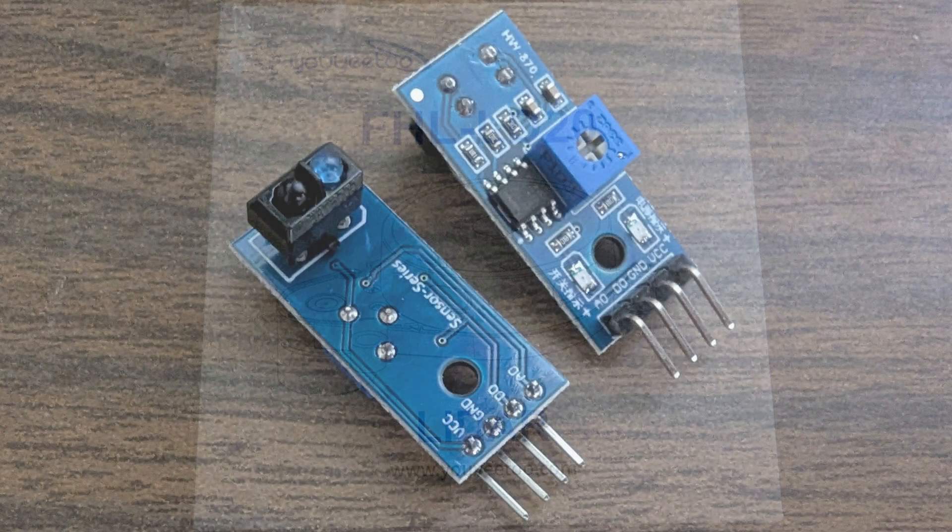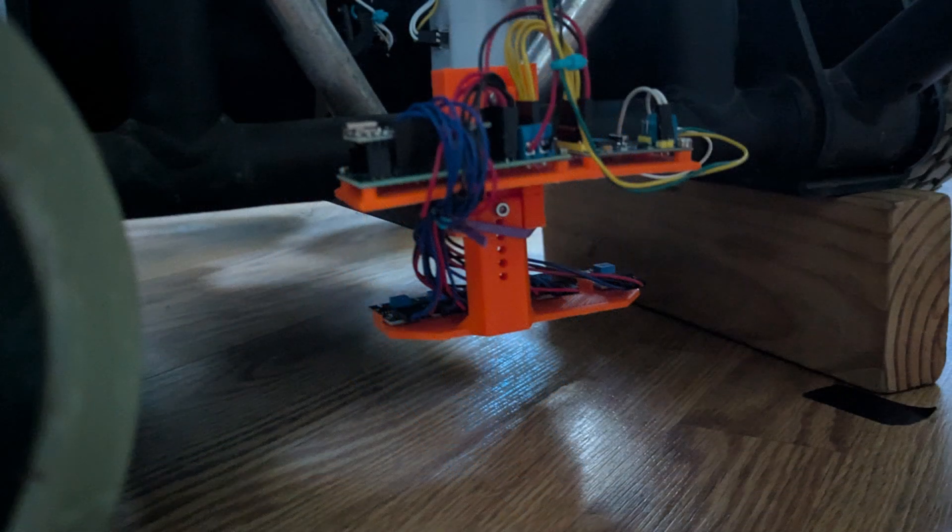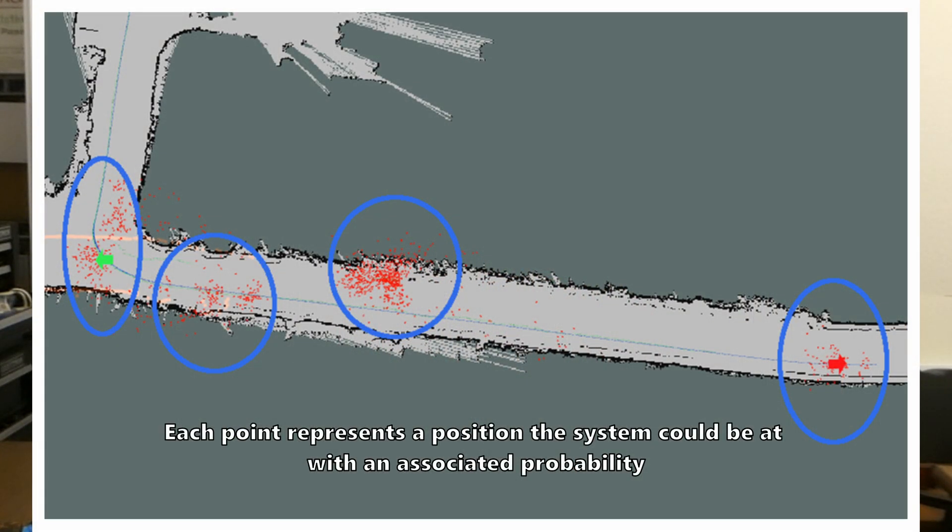In the previous video, I mentioned using LiDAR to sense the location of the vehicle. Since then, I've changed the control system on board from using LiDAR to using infrared-based color detection of the floor. This offers many of the same benefits as LiDAR — namely a quick setup and no permanent modifications to the ride space — while also having the major benefit of not being a probabilistic algorithm, and it's much easier to implement. With LiDAR, the best you can hope for is a probabilistic distribution of where the vehicle is in the ride space; you will never know exactly where it is. But with this infrared-based color detection, I will know exactly where the vehicle is relative to the ride profile it's meant to be in.